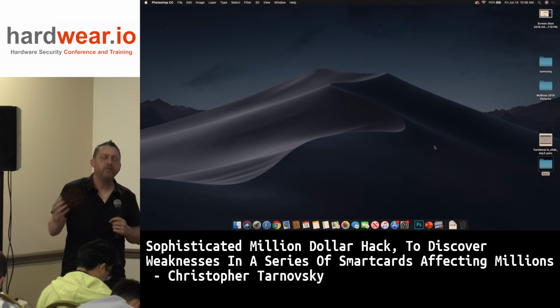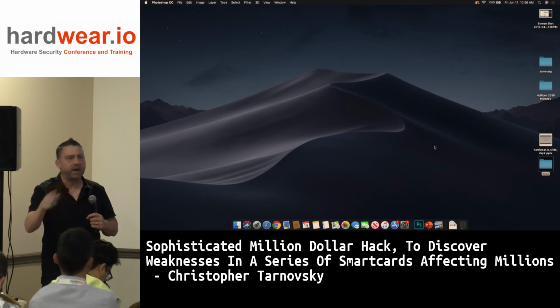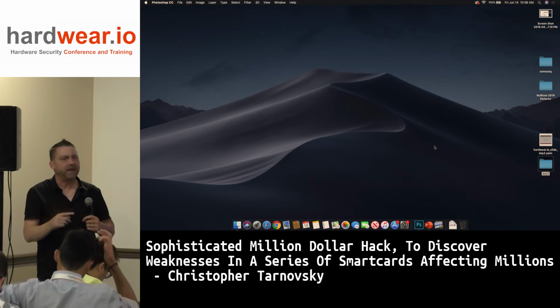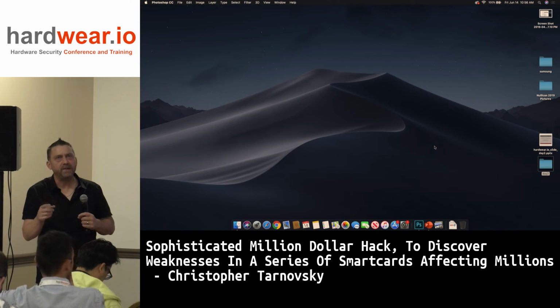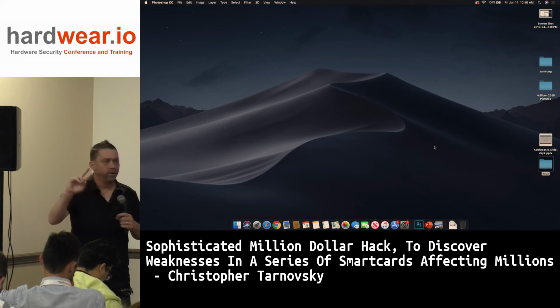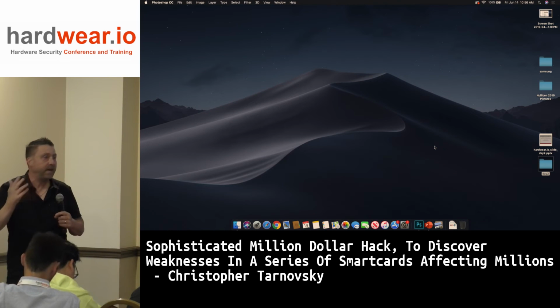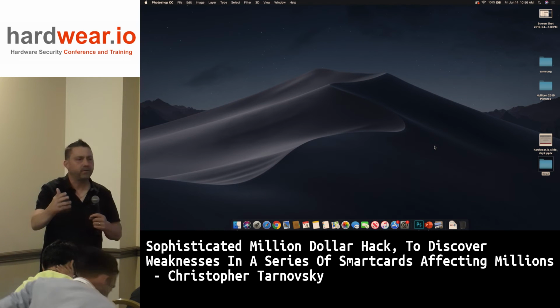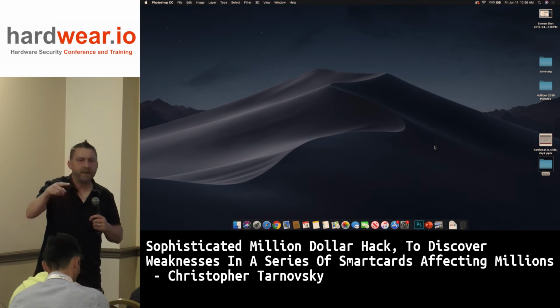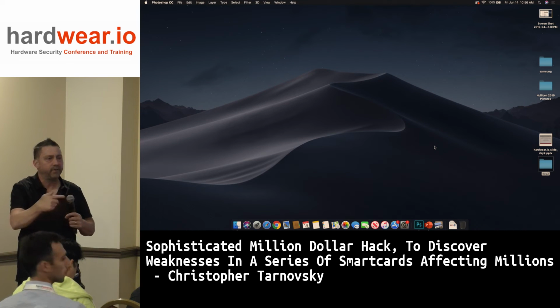So it's extract the boot ROM first, understand what they're doing, skip all of that, make it just branch and jump right into flash. The chip needs to see I'm branching into flash from the boot ROM to throw the mux, to switch the bus going into the core from boot ROM to flash. So you strap the address to make it just power up and jump right into flash. And then you cut those flash lines and you listen on the left. So you cut them to the right and you listen to the left. The left side is the data. Right. The right side is seeing FFs. Yeah.